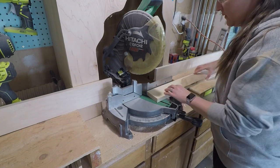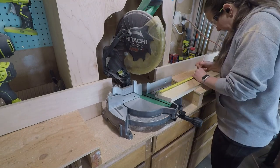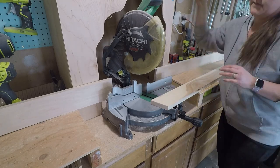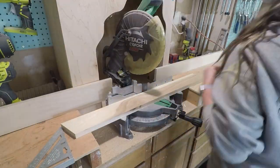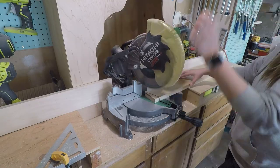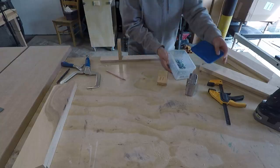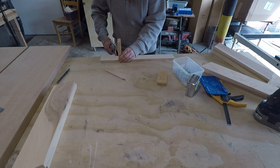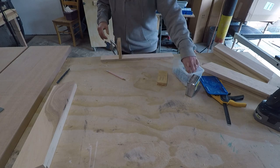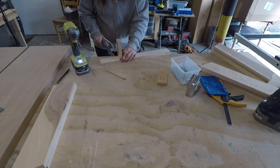The X legs of the bench are super easy to make. It requires four pieces of 1x4 cut at an angle. The most important thing is to make a stop so that all pieces of the legs are cut at the exact same size — that will ensure that you have a nice sturdy leg for your bench. Once I had all my leg pieces cut, the next most important part was making sure that when I assembled them, it was perfectly even between the two X's to make sure I didn't have a wobbly bench. The best way to do that, I discovered, was with a simple jig.